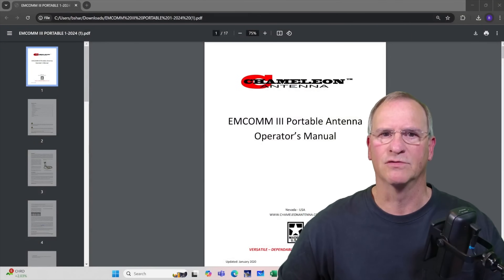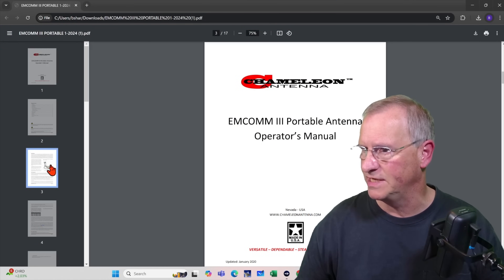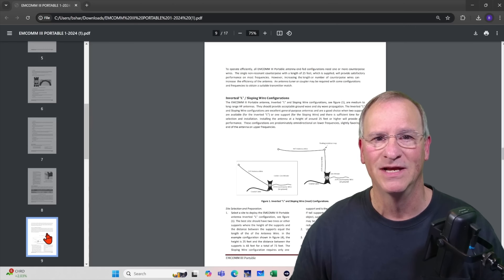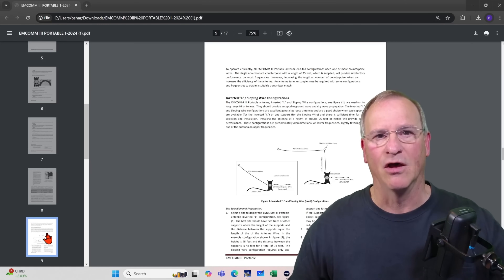I've mentioned the value in the Chameleon Antenna Operators Manual, but I've searched through it and nowhere can I find this sloping inverted V configuration — I see everything but that. I want to address that directly: you should always install antennas according to the manufacturer's recommendations and specifications. They've designed the antennas to work in a certain way. For me, this antenna is not in free space, which would be its best operating condition. It's best operated as an inverted L, inverted V, sloping with the matching unit high or low. A sloping inverted V is nowhere mentioned — don't be cavalier or reckless with your antennas.